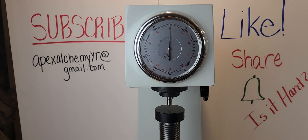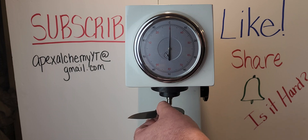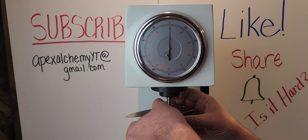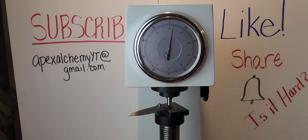We'll do the Vosteed — that's the one that's in my hand — and we will see which one is harder. Harder doesn't necessarily always mean better. There are nefarious ways that you can get a knife hard by not properly tempering, but for the sake of these videos, we will assume that all these companies have heat treated these knives to the best of their ability and followed some sort of standard.